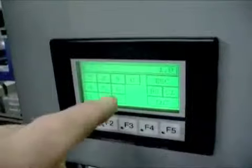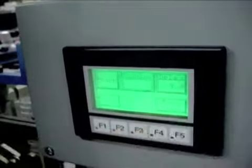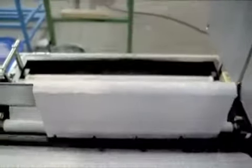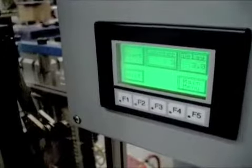Setting the timer to three seconds — when I hit start, it will wait three seconds, then the book will go down and you get glue. You can do fifteen seconds, which gives you enough time to put the cover on and take it off before it goes down again. Normally you'd set it to ten to fifteen seconds to give the operator time to put the cover on before the book wing goes down again.